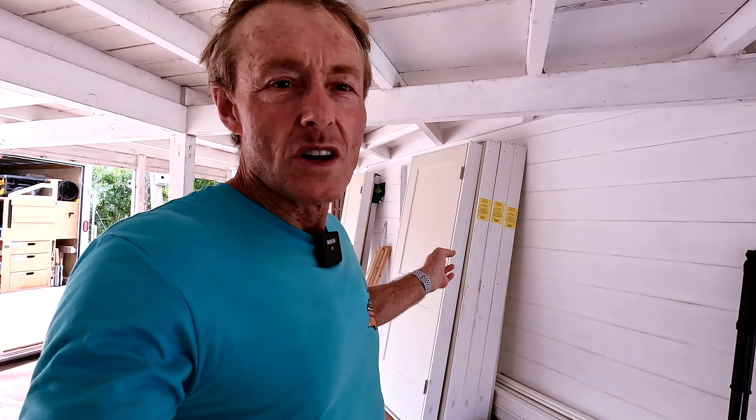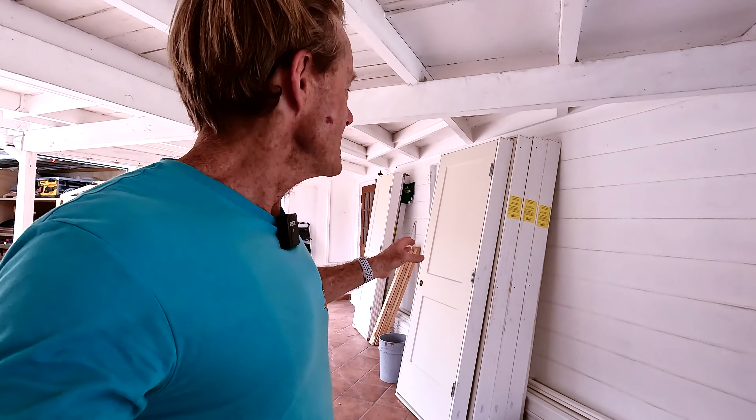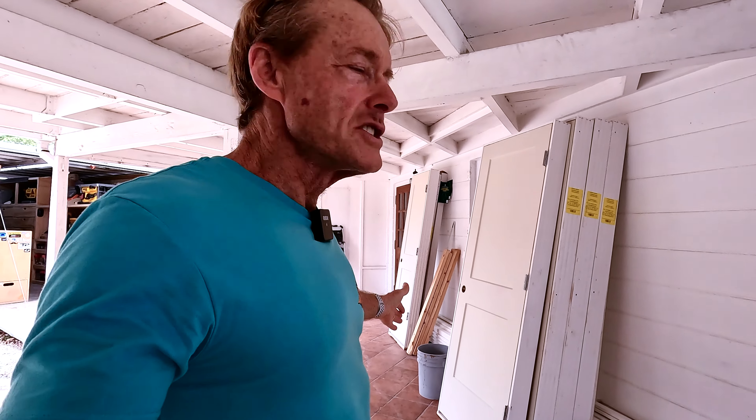This time is a little different. I ordered these doors standard height — 6'8". The house has lower ceilings and some really interesting architecture, but one of the drawbacks is that a lot of standard things don't fit, doors being one. All of the areas where interior doors go, the doors are too tall. So I have to cut down the doors and the jambs, which means I have to take the screws out, pop the doors out of the hinges, cut the doors, and then cut down the jambs.